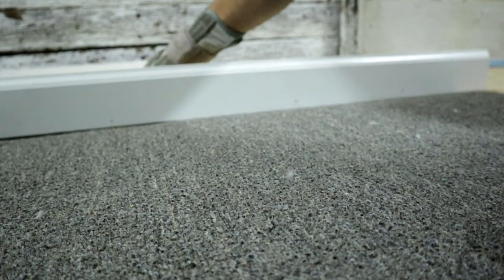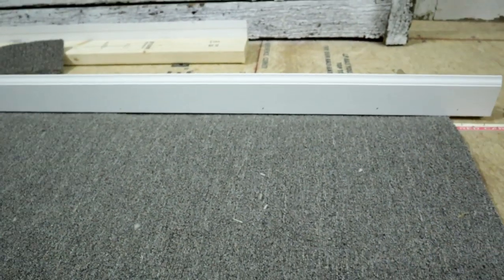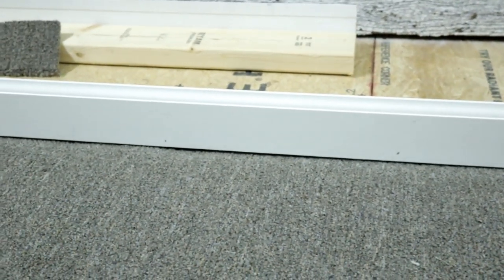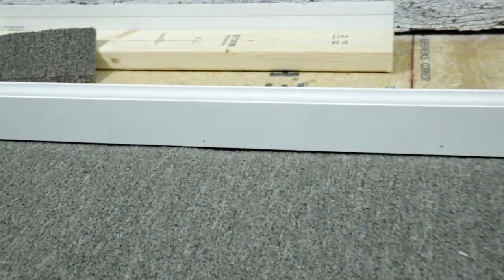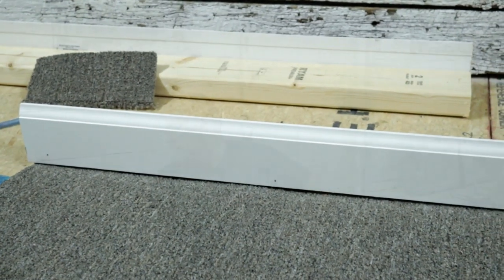So I'll rake that with my stair tool so it doesn't come off just like I did a while ago. You can hear that? Okay, so look at that already. That already made a huge difference because it's down on the strip now. Look at that. And I just grabbed it and pulled it. Now, because it is down on the strip, now look at that right there. A while ago, it was actually floating above the strip on the tacks. But now that the tacks are pushed in the carpet, as it has to be for you to get a stretch, look at that now. Okay? So that is definitely not going to fly, okay? You could scoot your tack strip closer and completely avoid this, okay?